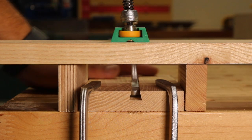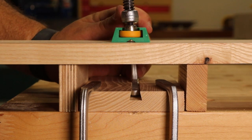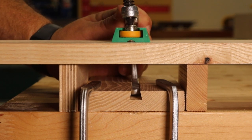I was able to make the plywood break, but I had to pretty much cheat. I'm thoroughly impressed with the plywood — that really did hold up well. Plywood is definitely an excellent option for this. If you can't make it fail with the piece raised above it, it's never going to happen in normal use when whatever you're clamping is laying flat on the surface. It's just not going to fail — there's no way. On to the ash hardwood. After seeing what the plywood did, I just have a hard time believing I'm going to be able to make this ash fail in any way, but we're going to give it a shot.